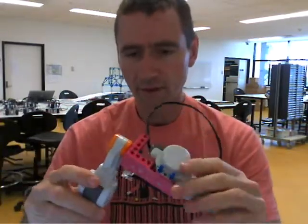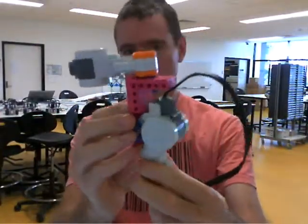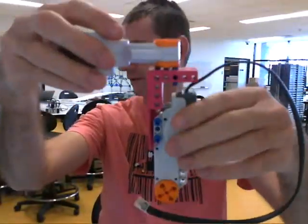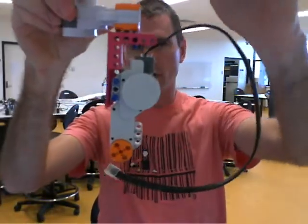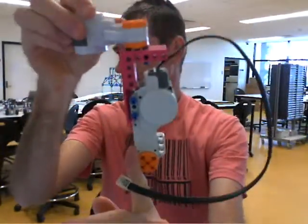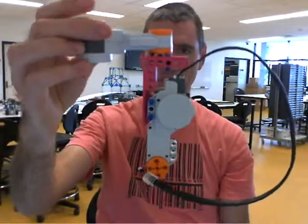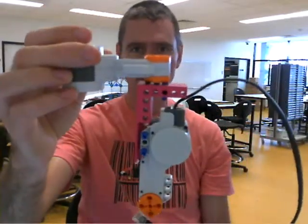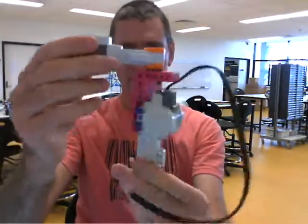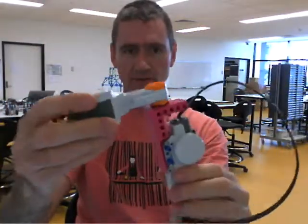Another idea: how can I have two motors hooked up together? Here's an angle section I've designed — it fits into that motor so the motor can rotate it. Because I've got the hole spacing right, that center line is directly in line with the wheel, so it rotates around and then the second motor can rotate too. You can have a directionally controlled motor drive for one wheel. If you had one of these on each corner of a robot, you'd have fully directional drive for each wheel.